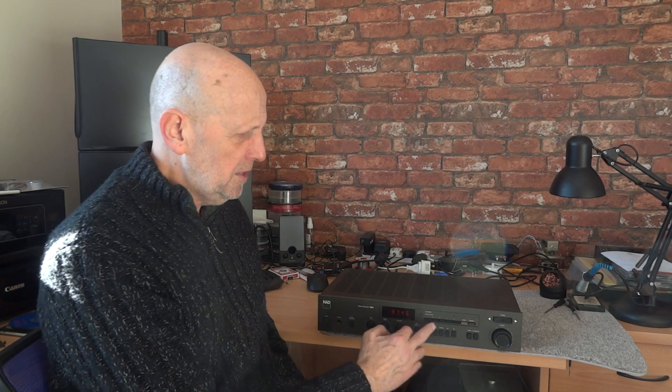He's had it about three months, and he came back to me saying something had gone wrong. He can't tune in his stations — he's pressing the buttons on the front and nothing's happening. You have to give them a good press before they finally kick in. And when he comes to tune it, the search isn't always working. You press search and it should move up and down through frequencies, but sometimes it goes back to a preset. It's all over the place.